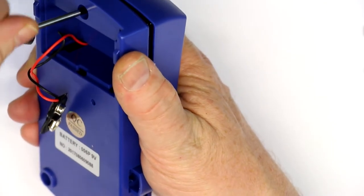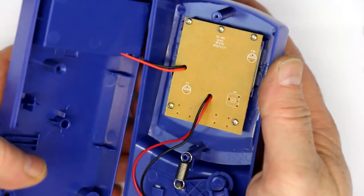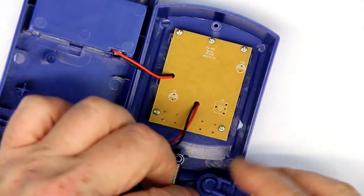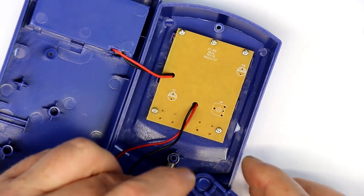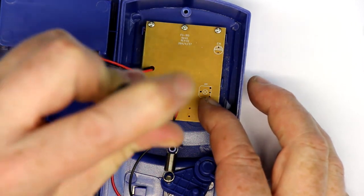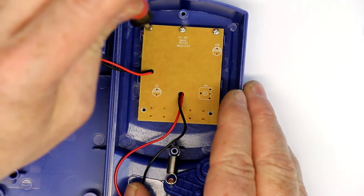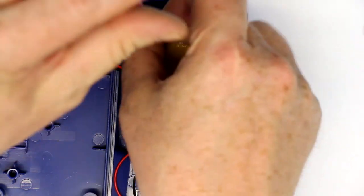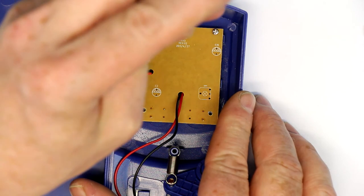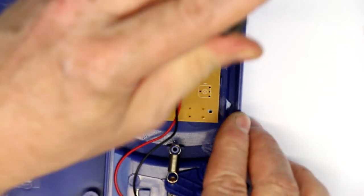Don't complain that the screwdriver is not the right size, I know, but it works for this purpose. And oops, the knob mechanism here is okay. It's also spring loaded, so we'll see how to get it back. So there's a single phenolic based PCB, which probably has, except for a microcontroller, probably only an op amp, because that's how the people at ELV did it. You just need an op amp to amplify the very low thermal voltages for, let's say, 100 times in that range, and then you go directly into the ADC of your microcontroller.